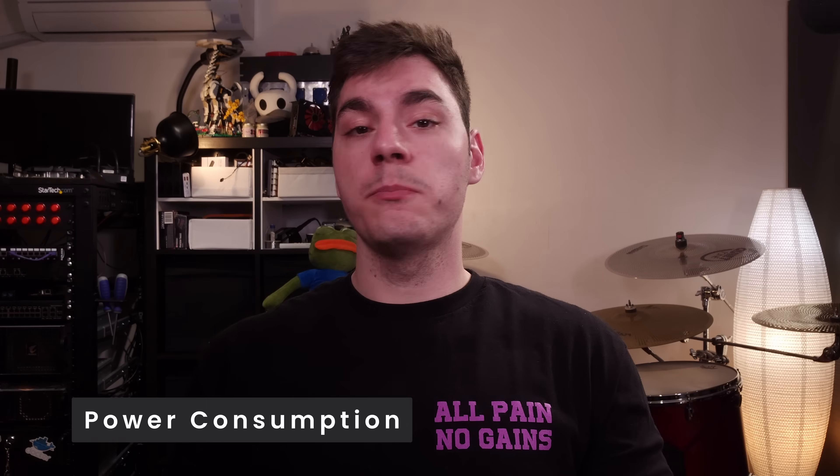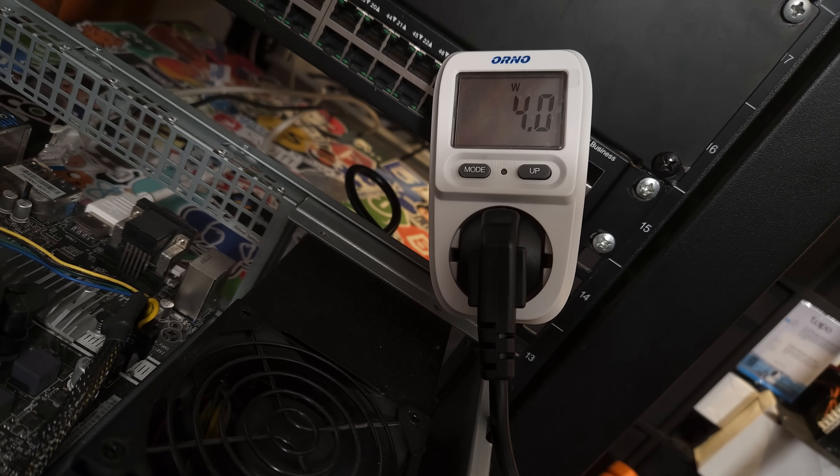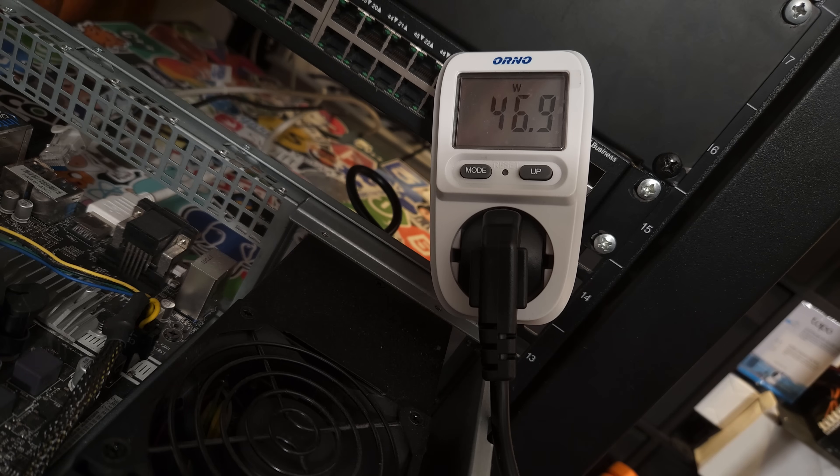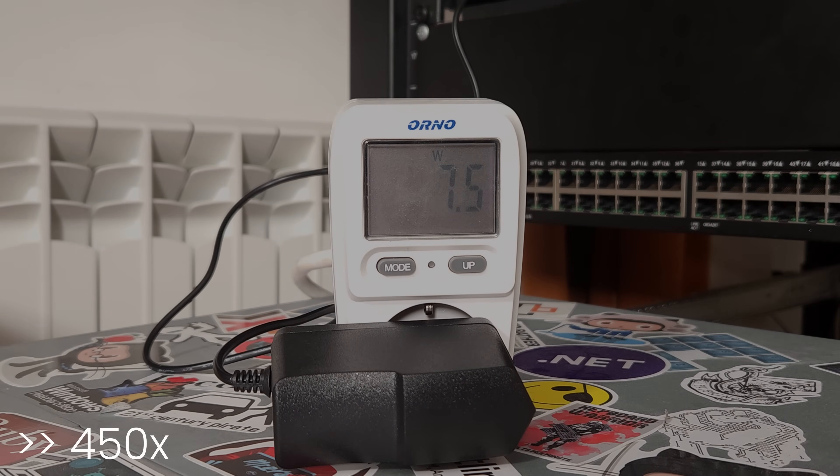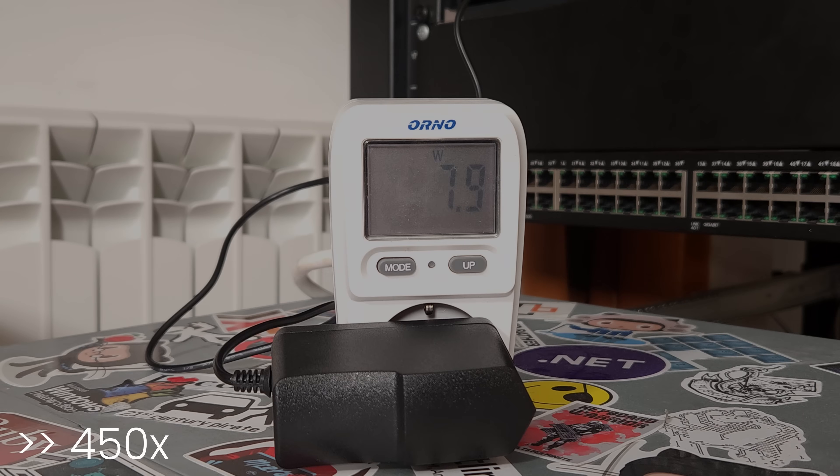Now that performance is out of the way, let's talk about power consumption. I was initially planning to run stress tests on both systems and compare the power draw. Then I plugged in my old router to a kilowatt meter and noticed it was drawing around 5 watts just by being plugged in. During boot the power draw would spike up to around 50 watts and settle at a 30 to 35 watt idle. The new MikroTik has a 24 volt 1.5 amp power supply so it cannot draw more than 36 watts, and it's usually idling around 8 watts or so. There's not much point running a stress test when the idle power draw of the old system is around the max possible draw of the new one — all while the new one has more and better network interfaces. Also note that for those figures the MikroTik had seven interfaces active as my main router, while the OPNsense box was just idling with nothing plugged into it at all.